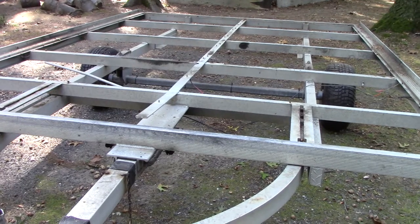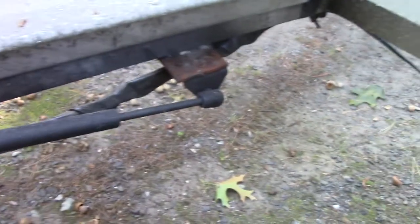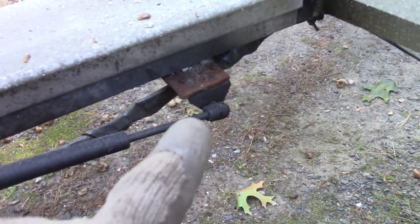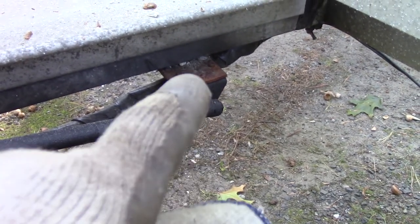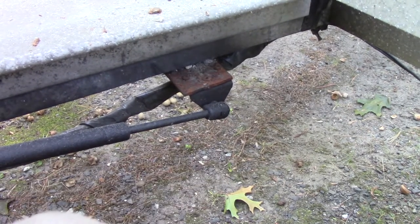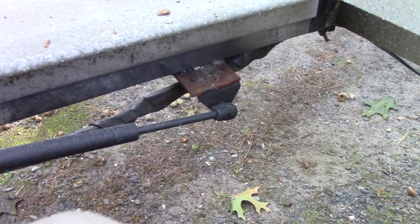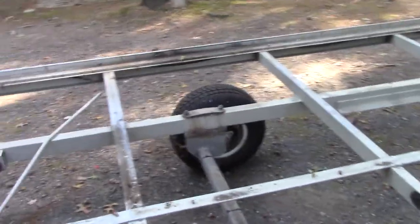Here's one of the trailer props - there's one on each side. That one is metal and I'm going to replace it with aluminum because it looks like it's already coming apart. Can't have steel on aluminum, obviously - learned my lesson. But when this trailer was built they did use steel, and this is the part I was worried about on the axle: there's a steel plate under here.